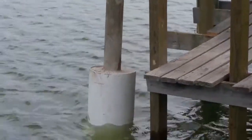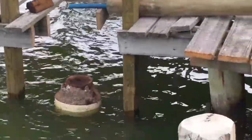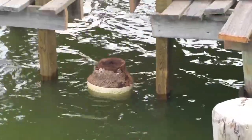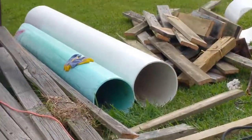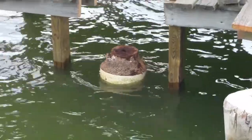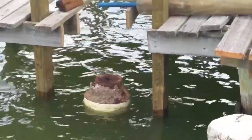There's the other one that I did a repair job on — it's pretty well cured out now. I'll set the bolt in there, then jump in the water and clean all the barnacles off the outside, then come in with my overshot pipe. Put it over the whole thing, drive it down into the mud as far as I can, then cement the annulus up and let it cure out.